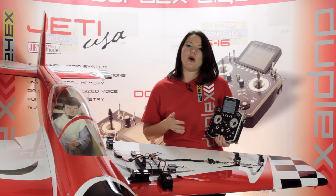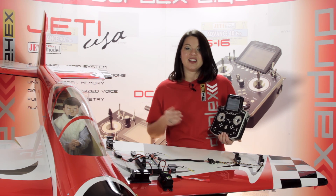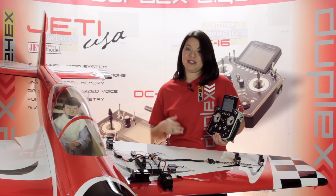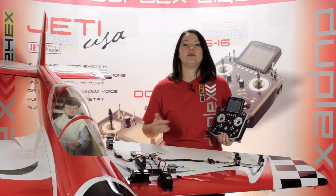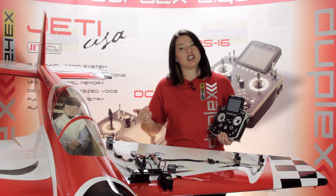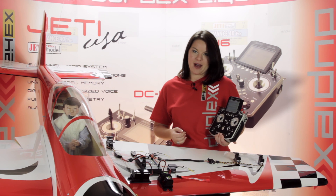But if the voltage of the batteries are different, the power is not shared and each pack is actually isolated from each other. This allows you to use batteries of different capacity, of different cells, and of different chemistry type. When you're in the advanced power setting, you can independently adjust power input voltages. This way, the battery with the higher voltage can actually be used as a battery backup and you can avoid constant charging and cycling both receiver battery packs.